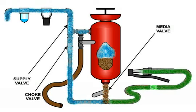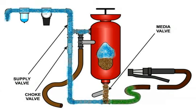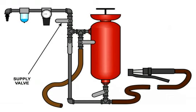If your abrasive flow is too high, the incoming abrasive is impeded by the rebounding abrasive. When the grit hits the surface, it must get out of the way of the incoming grit. If your abrasive flow is too high, you are in effect sandblasting your own grit instead of the surface you want to blast. When you're finished sand carving, close the supply valve.